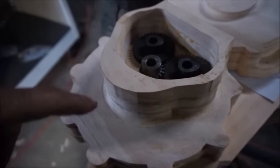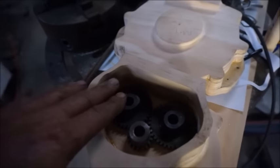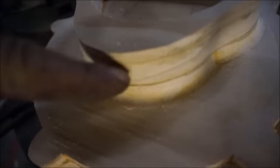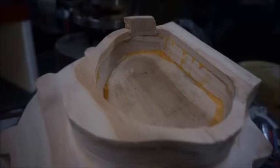I've got another one cut out and I'm going to go ahead and machine this down. We'll leave it a little extra because the surface will have to be machined after we cast it out of aluminum anyway. I know we'll have plenty of room. It's a whole lot easier to take material off than to add it on — about impossible to add on. I've got a quarter-inch where I wanted it, but I made my first mistake here — I was trying to take a little too much off. The good thing about wood is I'll glue it back in, saw it off, and sand it out. That should take care of it and still give us plenty of room for our lifters.